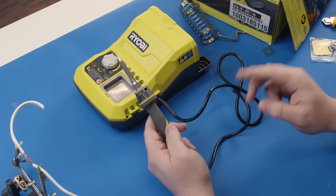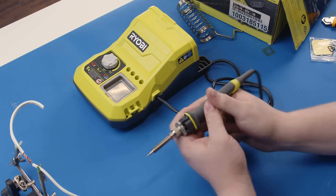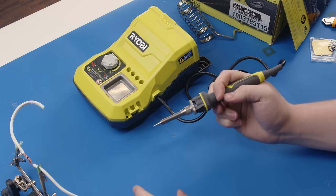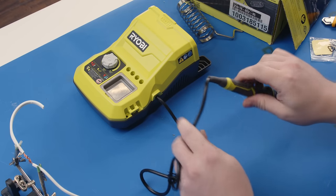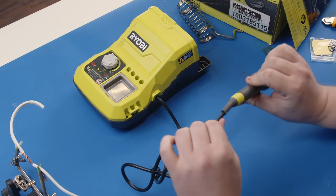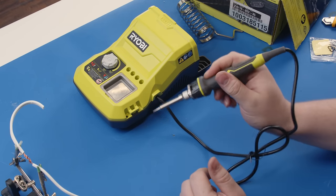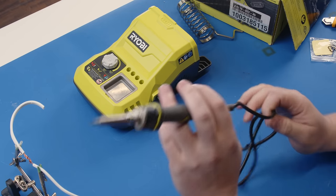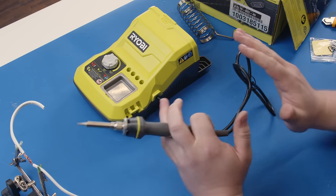There's two reasons for that. The first one is usability. Notice that as I'm pushing this thing around, as I'm trying to use this iron, the cord is getting in the way. It's fighting me. Obviously, if I unbundled it, that would be better. But no matter where I put this thing, it's going to have this intrinsic bend in it. And every time that I throw it into my tool bag, it's going to put a new bend in it. So every time I'm using this, when I'm moving it around, it's going to be running into my wrist, pushing away from it or pushing towards it. It's got a mind of its own. It's making suggestions about how I should move the iron, and that's wrong.